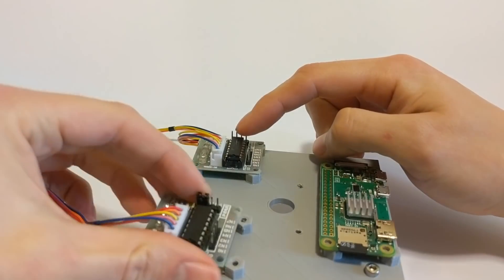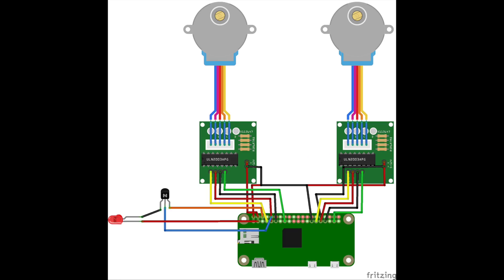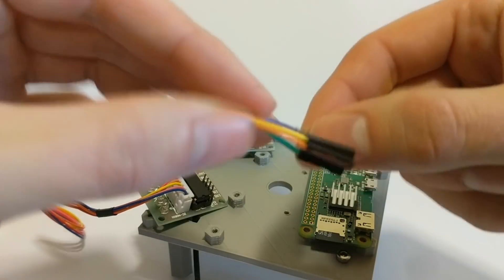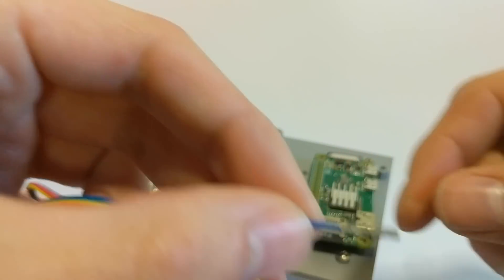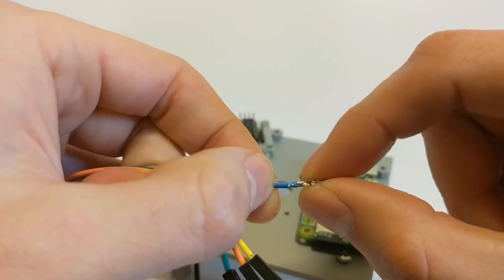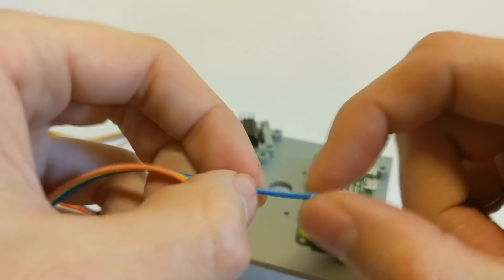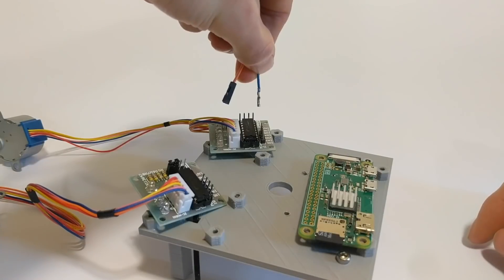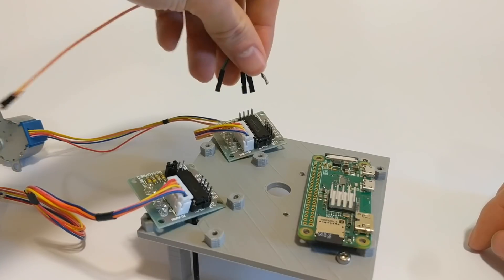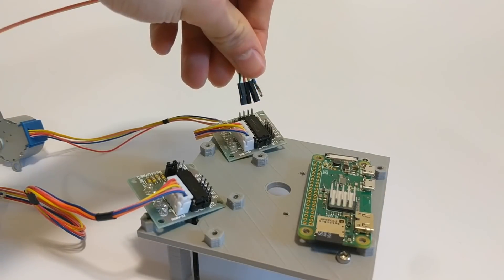Here's the schematic — this should be in the description below. We're going to be connecting those stepper drivers to the Raspberry Pi W. What I'm going to do is thread these on here, and instead of having these casings on, I'll put a little solder on them between these and the pins. That way it's a secure connection, and then I'm just going to put some heat shrink over it. If you don't want to do that, you can just plug these directly in with the casing and it should work, but I like things a little more secure.